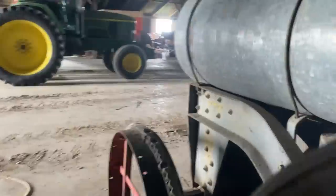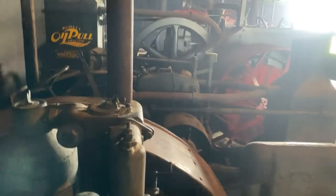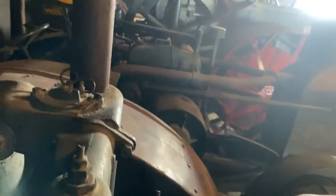We just pulled the tractor back into its parking spot. It's got a few issues I'll have to work on at a later time. Now that we have the tractor backed in, the way you shut this tractor off is about the opposite of starting it. Back at the operator's platform, turn your needle valve all the way in and let the engine start to run — it'll actually speed up as it loses gasoline. Then as it's slowing down, once it kind of stops firing, open your compression relief right there and it'll run the engine down and stop.